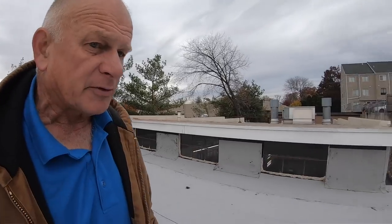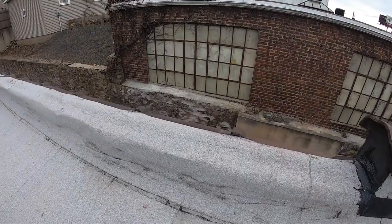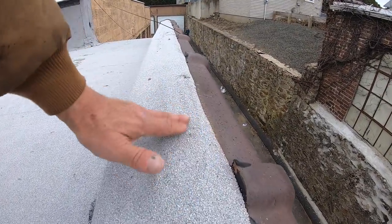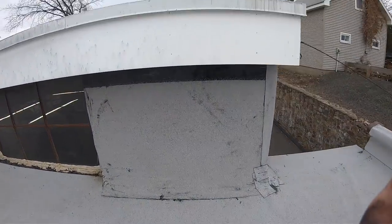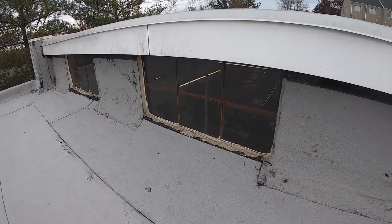All right, so we started this job yesterday. It's not a pretty job because of the roof that was existing here. It was very rough, but everything is much better than ever before. The walls are covered. We covered the walls with a membrane, and you can see we cut this half, and then we stick this in here, and then we covered the walls here. Walls had tar before and I don't know what, and paint. So we made the transition here.